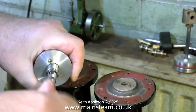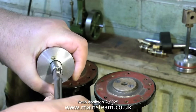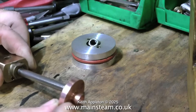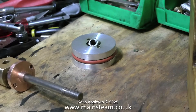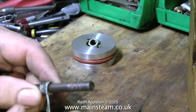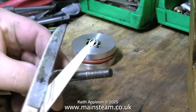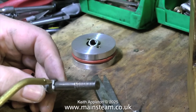As I'm now going to fit the piston rod and crosshead into one of the standards I do need to remove the piston. I've undone the nut and then the piston itself is also threaded onto the piston rod. Always put the gland onto the piston rod before wrapping the piston rod in graphite yarn. This graphite yarn is some old stuff that I've unpicked from a much larger piece of graphite yarn.